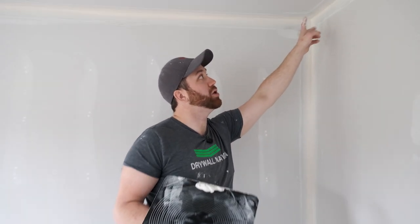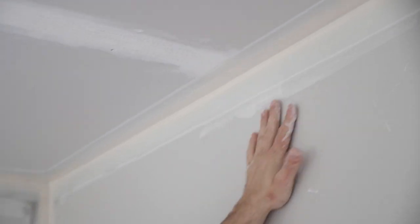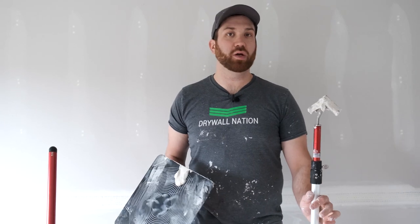We just finished taping, rolling, and flushing this room. If you look closely, you can see a nice even fill of mud on both sides of that tape — that's what you're looking for. If you get uneven spots, odds are your mud is too thick or you're using an angle head that's too big and not picking up enough excess mud. If you're not getting a nice even fill, either thin your mud down or use a smaller angle head for your tape coat. I hope this quick video on taping your inside corners was helpful — for more tips and tricks check out our other educational videos with Level 5 Tools.